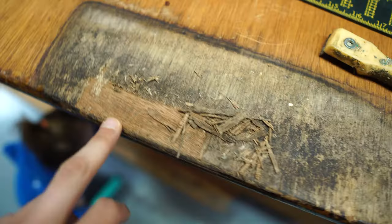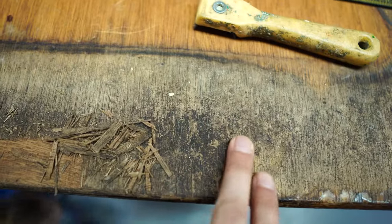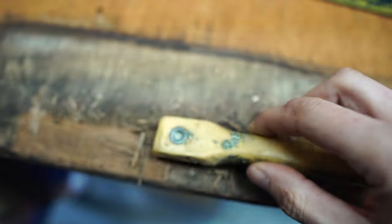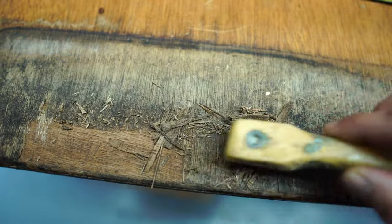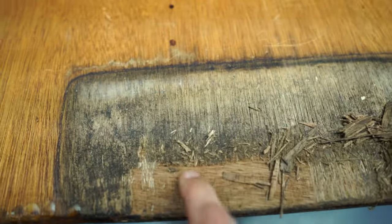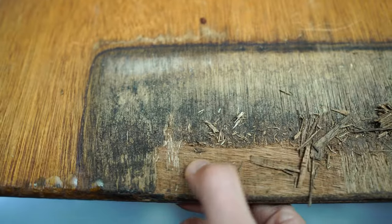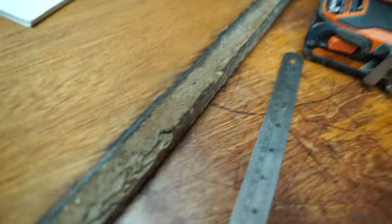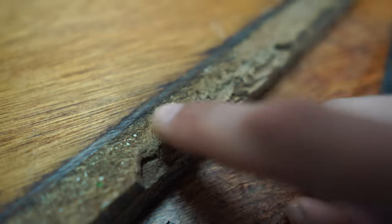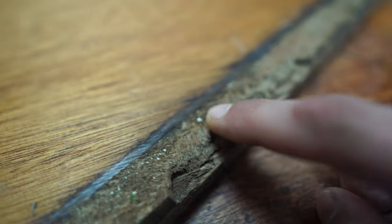This piece isn't varnished yet. As you can see the laminate is all rotten, so I'm just using this tool and it's coming up fairly easy actually. I'm just going to remove the first layer of the laminate for this section because it's rotten just down to the laminate. This wood is pretty nice — it's not punky or squishy — but over here you can see the rot has gone past the laminate and it's really quite squishy here.